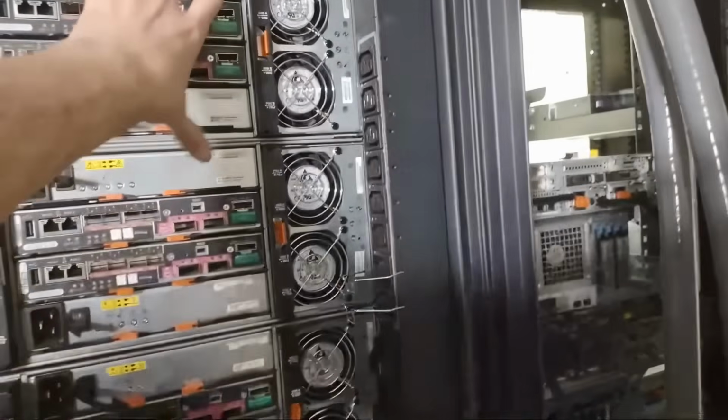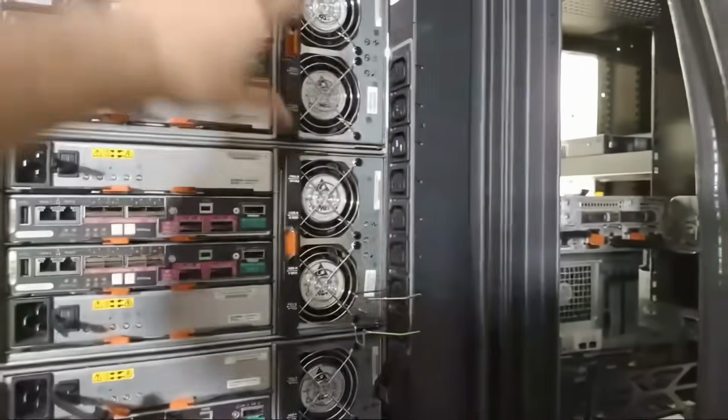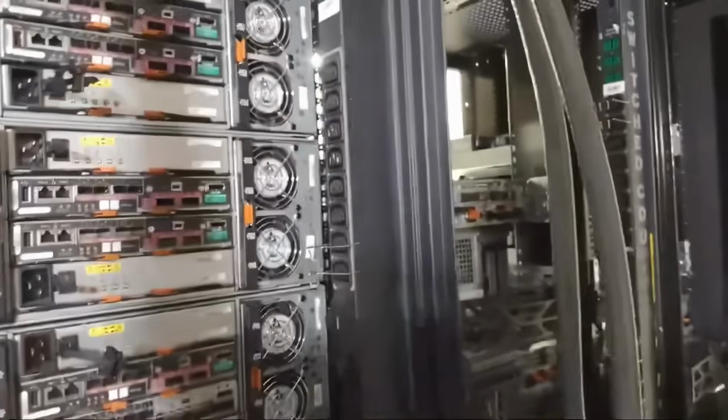This guy over here, I can see it needing not just one PDU, but two PDUs to power it adequately. So each one of these banks can do up to, I believe it's 8 amps or 9 amps if you're going to run all of them at the same time and still stay at your 80% derating. So that's close. That's very close. I mean, initially, I'll only have 2 of them running full time.